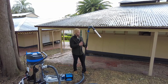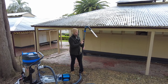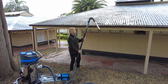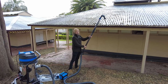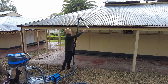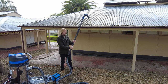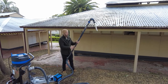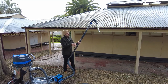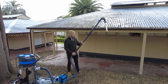I call it the six senses when carrying out gutter cleaning. If someone is blind or visually impaired, they can still clean gutters with this tooling. We listen to the airflow at the tip, feel the tip in the gutter — soft and spongy versus metal on metal — hear the air at the tip, feel the airflow through the poles, and feel the temperature of the poles. As the poles become colder, it's an indication they are full of mud and need to be cleaned. They'll also become heavier. Having a flexi tub with a few litres of water lets you clean the poles — a gulp of water shoots down the poles and removes the mud.